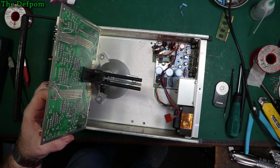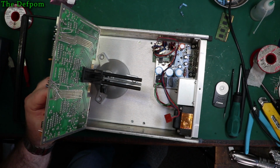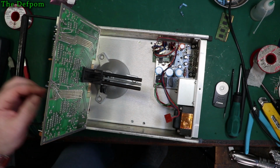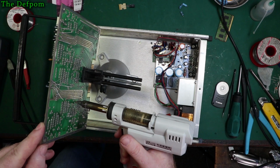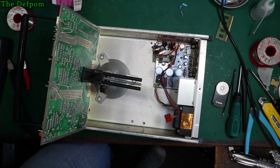Okay, normal here, which is a 100 microfarad 25 volt. The voltage is a bit different to what I'd like. I like to keep it within a region. 50 volts is quite a big jump. I prefer to go to like a 35. Shall I have another look, see if we've got one.